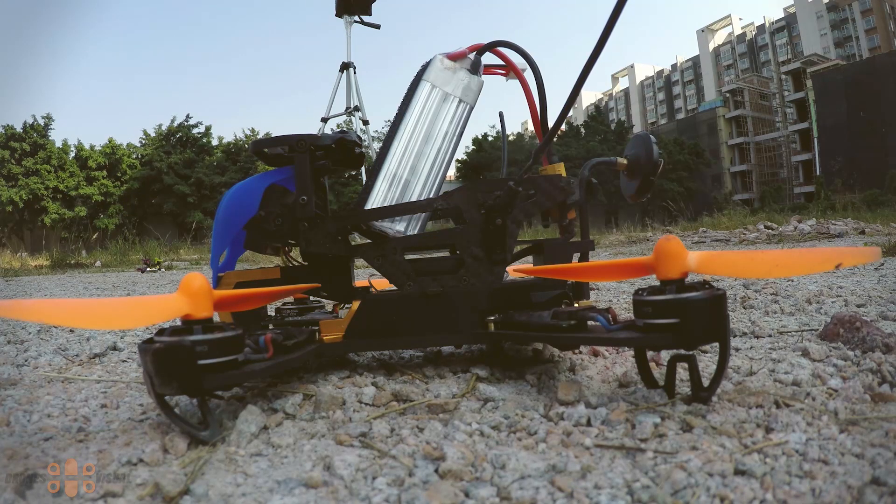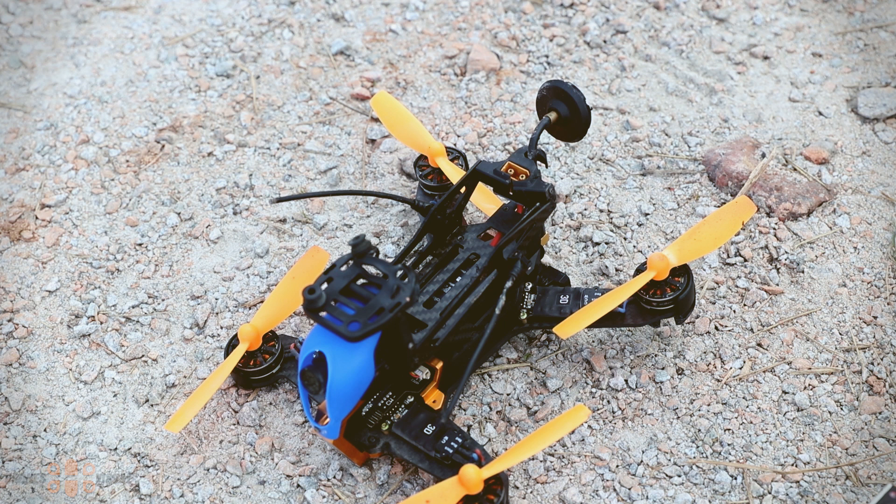Most of the components I need to replace are rather cheap: lateral carbon fiber plates, landing gear, antennas, and the battery plug support. So the quad survived a crash and a bursting battery without much trouble. Even the camera support is sort of half alive. As for the camera, despite these heavy life-threatening injuries, it's still operational. I think the moral of the story is: choose your batteries wisely, always expect the unexpected when flying, and choose your flying locations wisely — make sure there are no people around. I would also suggest you don't get close to your LiPos while they're burning. Keep your LiPos in special fire-retardant bags or boxes — this was a brand new LiPo and it burst, so you never know with these batteries.